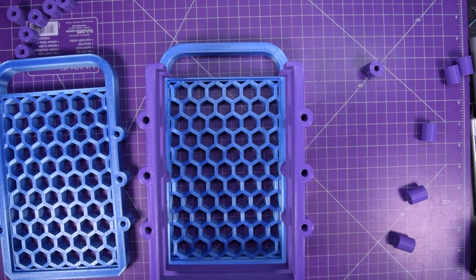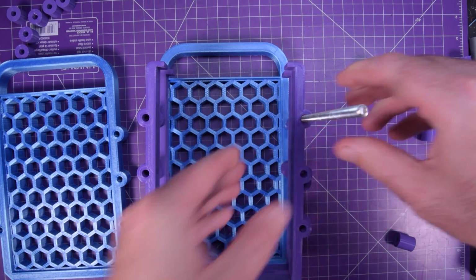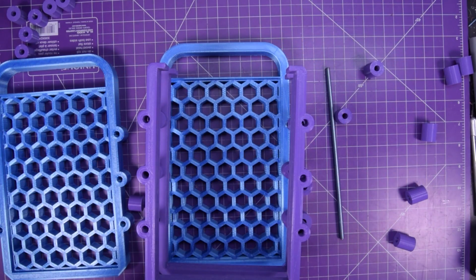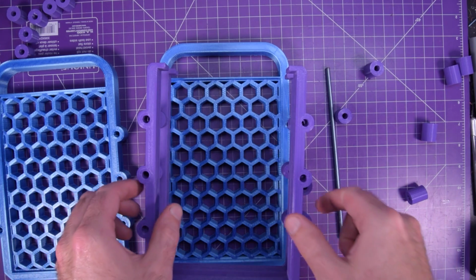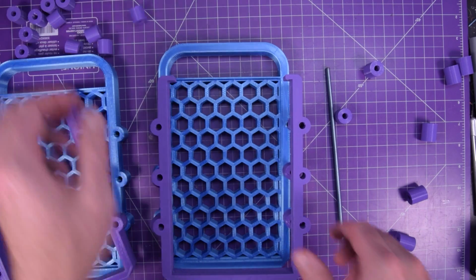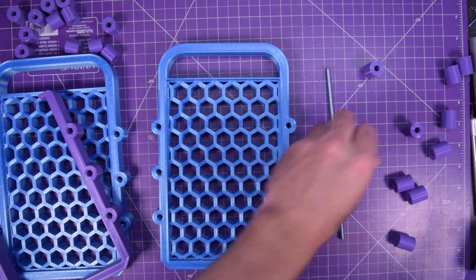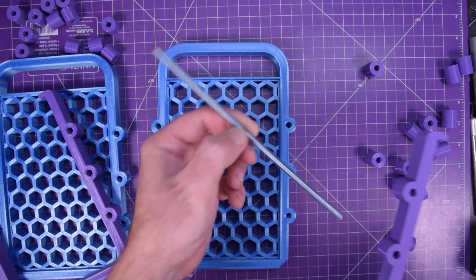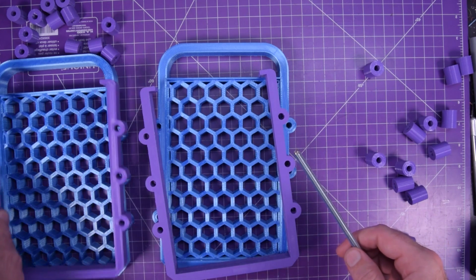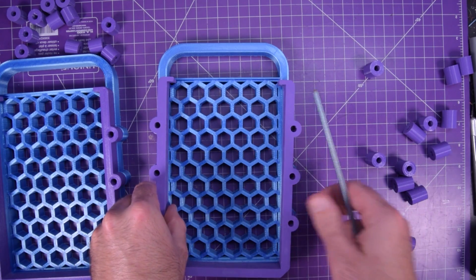And then you slide these threaded rods. These are 1/4-20 threaded rods. So you would slide these in, and then you'd be able to bolt them on each side and compress the cells. And so you don't 100% need compression, but you do get a little bit more life out of your cells if you do compress them. So that is the point. So yeah, this is all modular, and these threaded rods I just bought in 6-foot sections and then cut them to the length I would need to make a four series pack. And yeah, so that's going to be pretty cool.